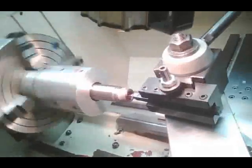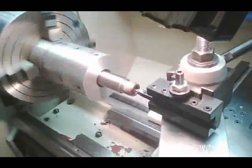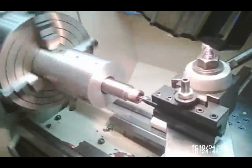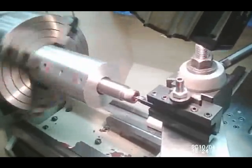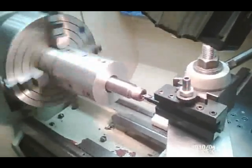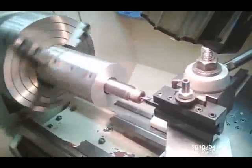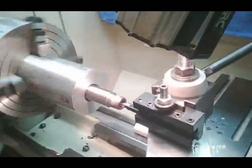The digital readout is really helpful. If you don't have it you're going to have to measure as you go along, but with the DRO you can set this up and it becomes a no-brainer. Single-pointing is something anyone could do — it's just time consuming and you have to be careful. It's not as easy as using the reamer from Dave Kiff at Pacific Tool. For any homeowner or hobbyist doing their own gun barrels, I'd suggest getting that reamer from Dave Kiff — always helpful to have the right tools.